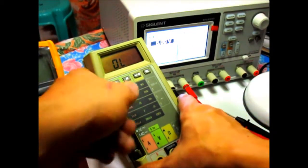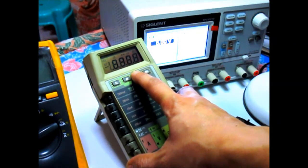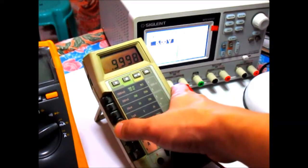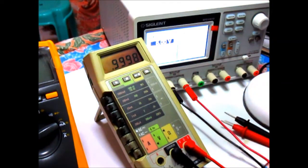It's simple. Just power off the unit, then you press this continuity button here while powering it on. Then it should display 4/8 with decimals. There you go. Then it should display the count. The decimal point just depends on where the range is. Right now it's looking good. It's just off by 2 counts, so this confirms the meter is working after all.